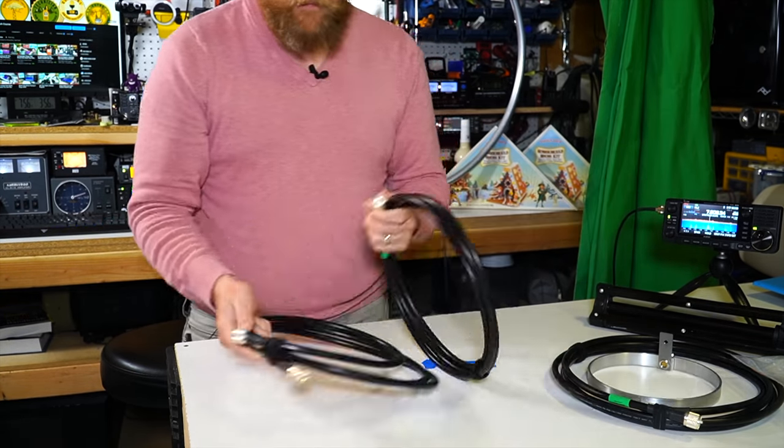Okay, just kind of open it up a bit. Rest it on the top. Take your Velcro strap, go over the top with it. Doesn't need to be very tight, just snug fit. Okay, now, pretty simple. The legs of the LMR 400 simply go down to the bottom of the loop capacitor box. I kind of jiggle the body of the cable as I'm tightening, and then adjust your tripod until you get a loop shape.